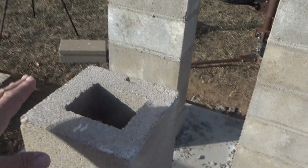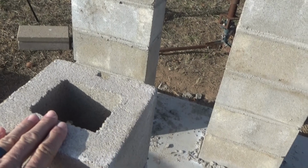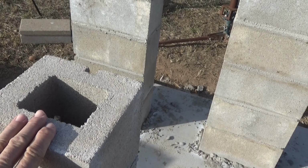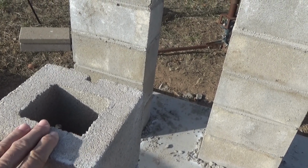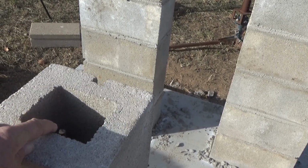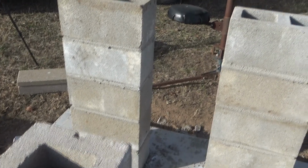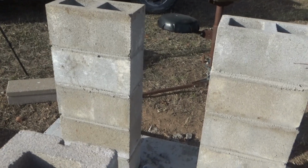And what I intend to do is have a dome of concrete here that's going to act not only as the concrete inside, of course, but it's also going to be the mortar between the columns and the top. And I don't expect it to adhere well. That's not the real retention mechanism. The retention mechanism is the doweled-in rebar to keep, like, thermal creep, hot and cold cycles, expand and contract throughout the years. I don't want it to start walking off of here.